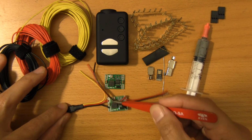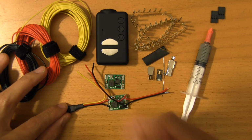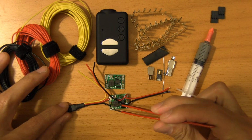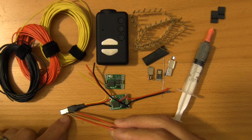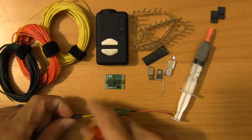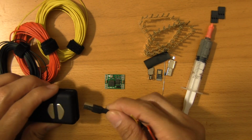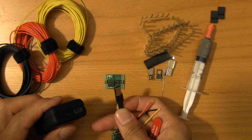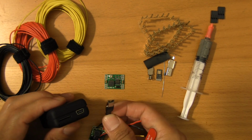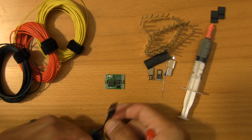Now on this side, these are the outputs, and on a multimeter, again, I turned that trim pot until I saw about 5.1 volts, and this is what's actually going to go out to the USB port. This USB is a USB Mini B plug that I sourced from Allied Electronics. You can also find these on eBay and DigiKey. They're about $1 a piece for the entire assembly.